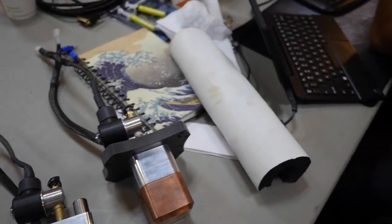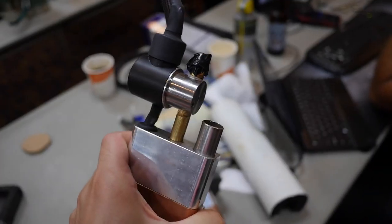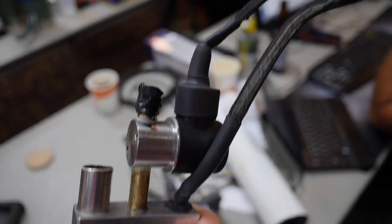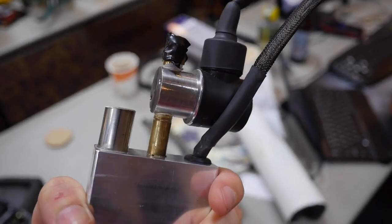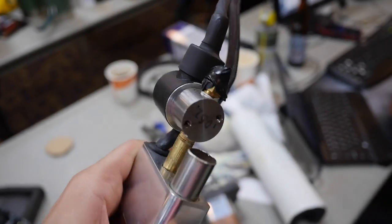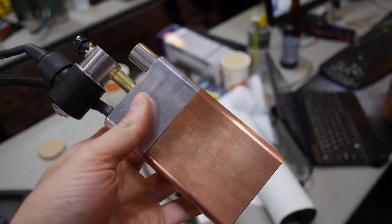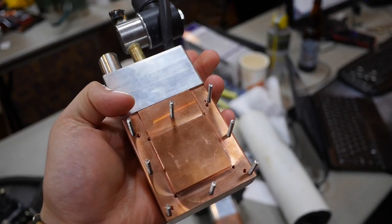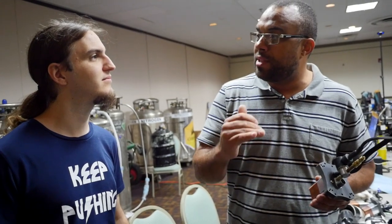At the same time, during a benchmark, you need more liquid nitrogen because it keeps it cool. So if you hit the end of the benchmark, all of a sudden you don't need that liquid nitrogen and you're going to cold bug. That's why you use torches: you jam the torch in there and light it up and that warms it up. Well, with our process controller, instead of us needing to respond to that, it automatically responds and begins to add heat.